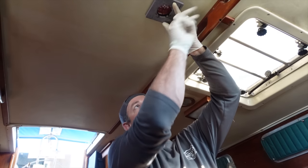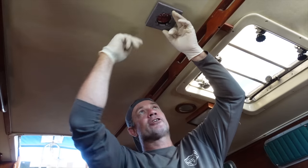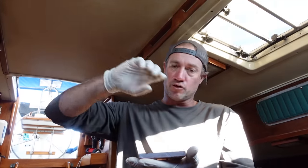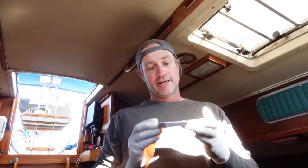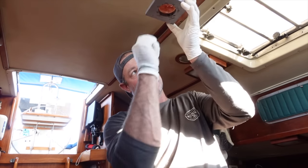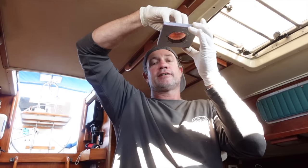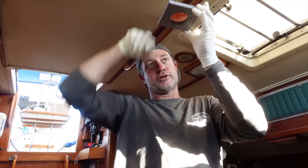So I'm going to tape that in, and then from the top I'm going to fill. The existing amount is quite thick, there's like two layers of board up there where the windlass sits, so I'm just going to pour resin until it fills the whole section in. Once I'm happy and it's all filled in and the resin's run out into the little bits that had a bit of rot, then I'll drill back through this and I'll die grind this out nice, and we should have a complete fiberglass entry and exit point for the chain.